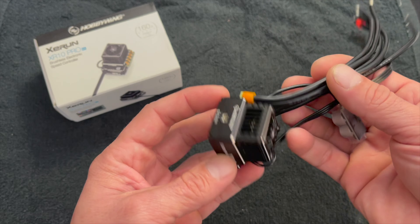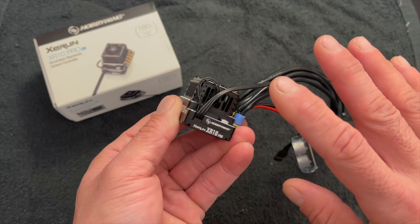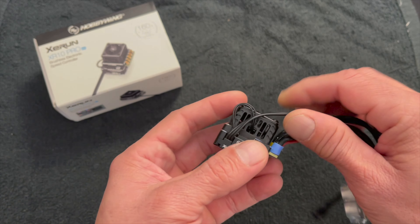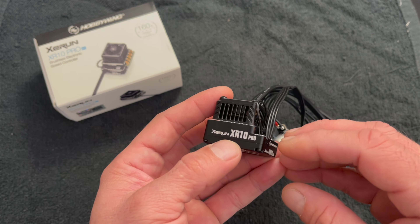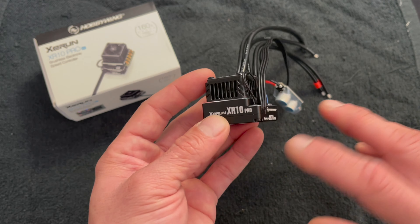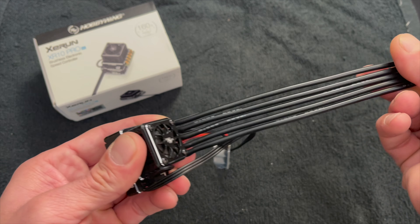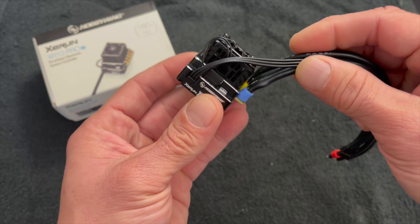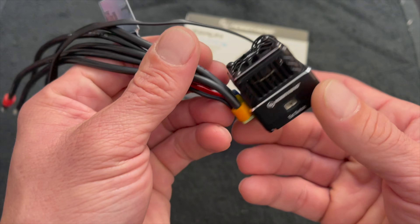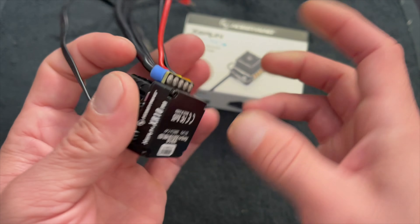What is new, what is different, what changed? The big things to look at are the external changes, but there are also some very important internal changes that help with efficiency. The new fan moves more air at the same power input, so you're not making the BEC do any extra work — keeping everything cooler and more efficient. Internally, the structure has been changed to allow better cooling and heat transfer of the important parts. The speed control now comes with the more favored 13-gauge wire, updated drag brake tuning with the drag brake rate feature, and reverse voltage protection built in. If you hook it up backwards, the included cap will pop, but you can just replace the cap and go. Non-polarity capacitors are also available as an upgrade for ultimate safety.